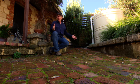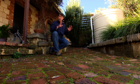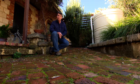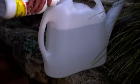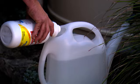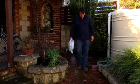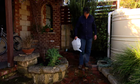You can get rid of it with a high pressure cleaner — you can simply jet it off and clean the surface — or grab yourself some bleach and a stiff bristle broom. Add 1 part bleach to 10 parts water and apply to the pavers. Spread the solution around and leave for about 10-15 minutes to allow it time to work.